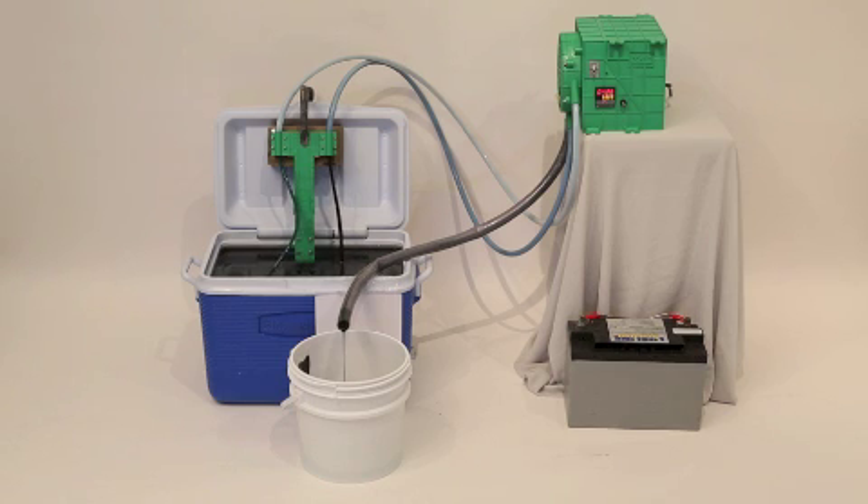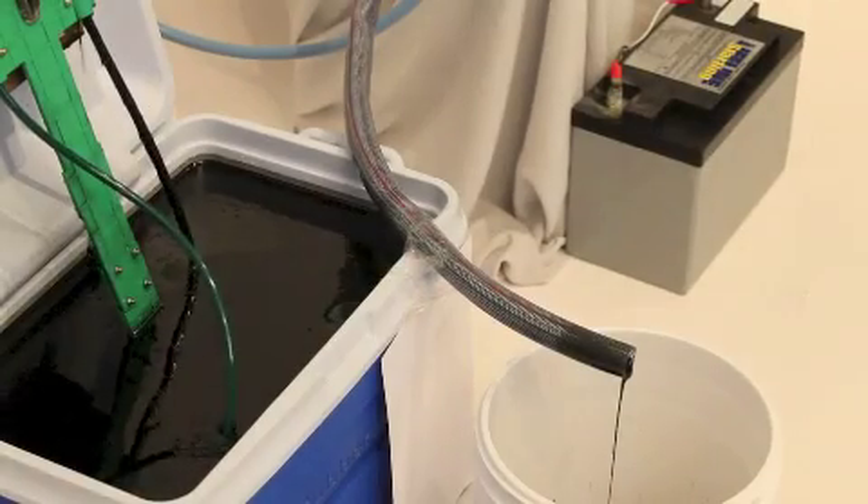You can see on the top of the unit itself it's got some lugs there for fitting it. So it can be screwed up under the floor sole of your vessel, or it can also be screwed onto a vertical bulkhead face. Then you just basically lower these tongues down into your wet bilge area. You just need to make sure it's passing through the surface level of your water. It's quite a long tongue on it — about 400 millimetres long — so there's quite a wide variance of water depth you could have in your bilge. And it's okay to pump your bilges to a certain level because the pickup is from the bottom of the water where there is no oil. But it's very important that it just passes through that oil slick.